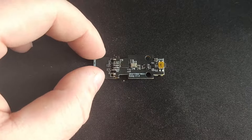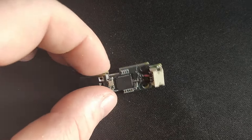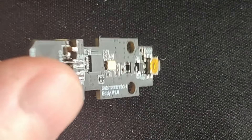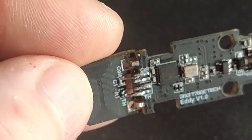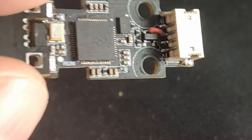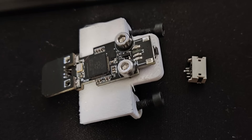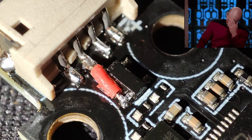Now, what I did to it. I made it flat because it fits my print head better this way. That involved desoldering the coil and soldering wires to those two tiny components. It took me about an hour and I had to use a hot plate, microscope, really tiny soldering iron tip, precision tweezers, hot air station, and a lot of dexterity. I really should buy myself some thin enameled wire which would make this job a lot easier.